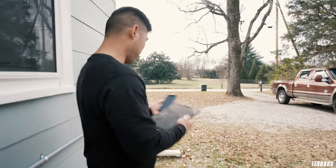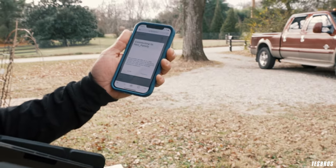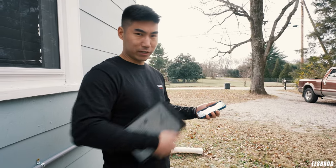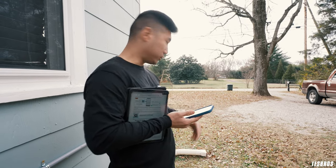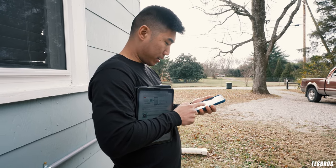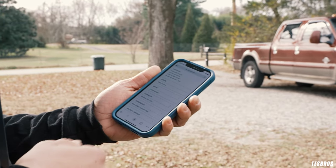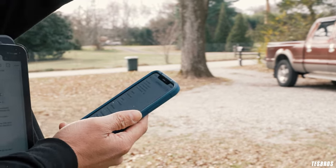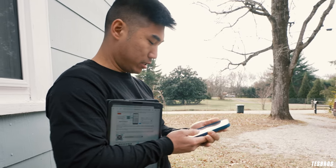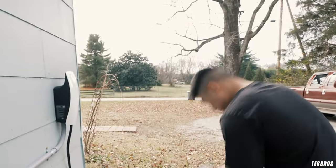To test it you need to activate it with your phone. Connect to the charger's Wi-Fi network — there's a password — and that takes a minute. The key difference from Gen 2 is that Gen 2 doesn't do firmware updates or connect to Wi-Fi, but this one does. If you're running a fleet of chargers you can turn them on or off on a schedule. Once Wi-Fi is connected, I can see the max output is 48 amps. It was set to 32 for some reason, so I updated it to 48. With a 60-amp breaker, your maximum actual output is 48 amps, which translates to about 44–45 miles of range added per hour.